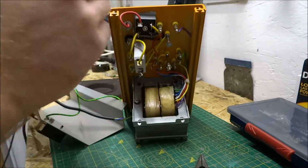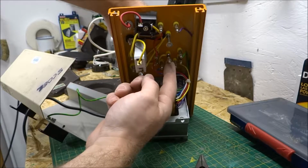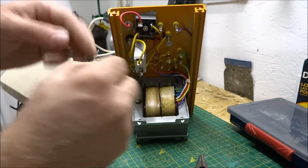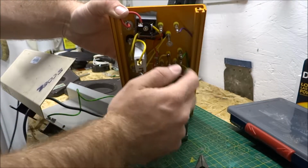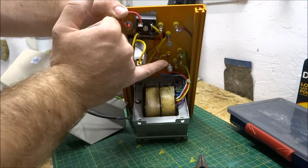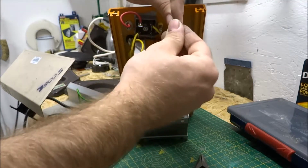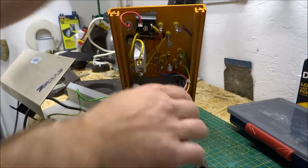Now obviously as this gets pulled up, turned and moved, the one nut that we've put on may very well come off because it's being moved all the time, much like the solder joint was. So we're going to use a locking nut system, which is where we have one nut on there, and now we're going to put another nut exactly the same on behind it. I'm just going to locate it for a minute. Now what I'm going to do is tighten this nut up against the first nut. So I'm essentially going to be turning this one right to make it tighter and turning the initial nut left, to loosen it, so that they tighten up against each other, and that will then create a complete lock between the two, which means that they won't come undone.